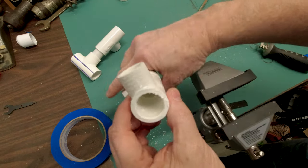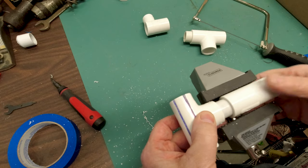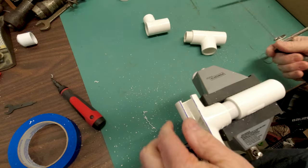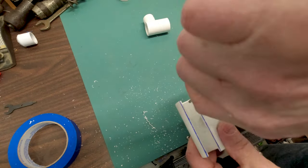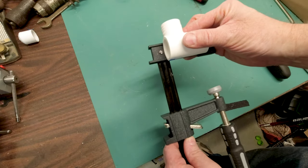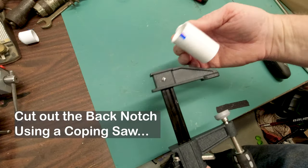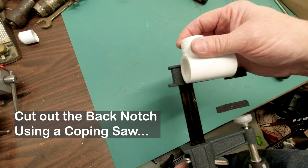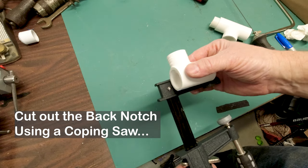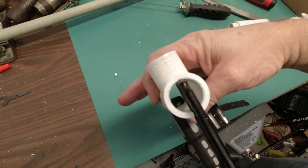That came right off and it's pretty flush — I'm pretty happy with that. Take one of these tools and just clean it up a little bit. Using another T, finishing it off — that piece is out. Then you can use the same tool to clean up that groove. Now it's time to show you the vision for this piece: I'd like it to sit right there, over the center of the clamp. The notch is going to help keep the piece straight up and down, and when I use the heat gun I want to make sure it molds as best as possible. It's pretty tight to the groove, which is exactly what I wanted, and it looks straight up and down.